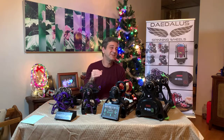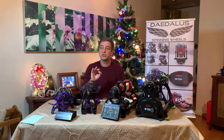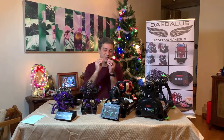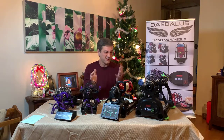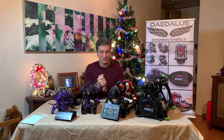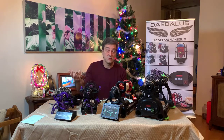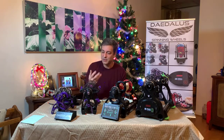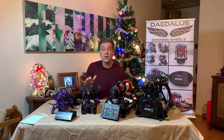That's another thing. I've had 3 belts break, and it was within 2 weeks of the user getting it. What happens, sometimes you'll get a void inside the splice that you can't see. But if you do, it'll always work itself out within the first 10, 20, 30 hours of use on the wheel. Outside of that, I've never had one, and you get a spare in the kit; put your spare on, I'll send you a new spare. Outside of those 3 people that broke like immediately right after they got the wheel, no one's worn out a rubber drive belt. No signs of wear.